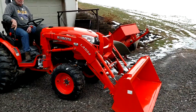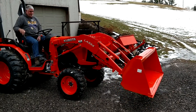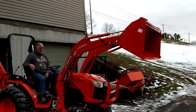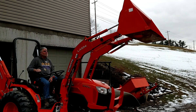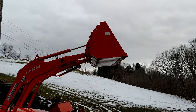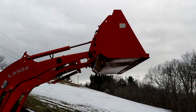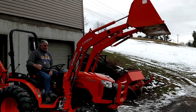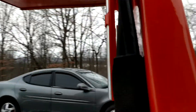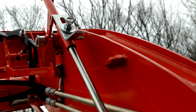He can go all the way up to the top — go as high as you can go — watching that end of that lever. He can work his way all the way up keeping the bucket pretty close to level as he goes, if he watches it. So are you level? Now to me it looks like you're slightly uphill facing — like your bucket's facing uphill a little bit. So right there? He's at whatever maximum height is — I'm guessing somewhere around six and a half feet. A little bit off. Keeping this keeps it almost perfectly level. And you can see that bracket, when he's at height, is way off.